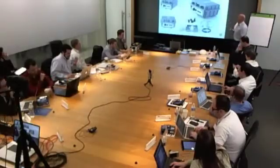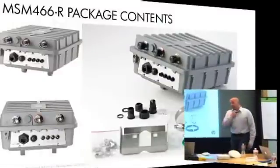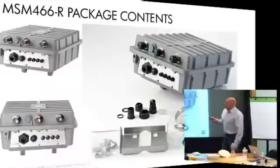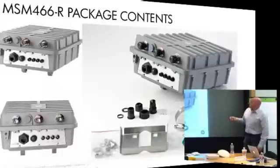Okay, so the 466R. Here's what the 466R looks like. We have N connectors instead of reverse polarity TNC for outdoor environments, and we don't sell the cable in between. We sell a lightning arrestor, but not a lot of the cables and connectors and different things that you may need. So we go with the standard N connection, which is a typical outdoor connection. All the sealant, everything's made. It's a great connection for outdoor environments. The 466R, this is the front. We have 3 N connections on it and 3 on the back.